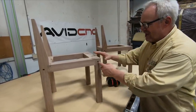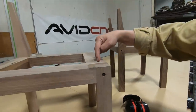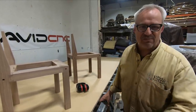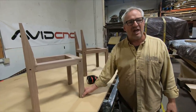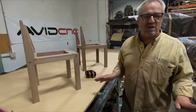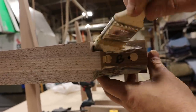We're going to use a number 12 by 4-inch long screw when we glue this and screw it into this component of the chair here forever. This will give a longevity of generations by putting this one screw in each spot here. I mean, it's possible after 30, 40 years of just weakness in the chair, maybe the glue joints start to separate a little bit. With a screw in there, the chair, unless it's crushed or broken, will stay together forever with one screw.